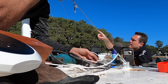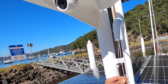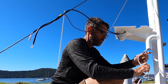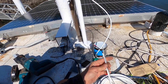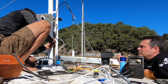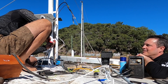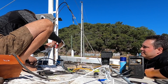Our other consideration is the camera cable. Pulling a little bit — can you see one moving? John just suggested that we pull the power cable for the radar and the original pull cable through and then just leave it there for future use. Thinking ahead — it's not something I'm very good at. When you're pulling Raynet cables, there is actually an accessory that Raymarine make which screws into the end of the Raynet cable. Then you can use a mouse line to gently pull it through. That's a great idea — especially if you had a really tight conduit. What a cool little accessory.